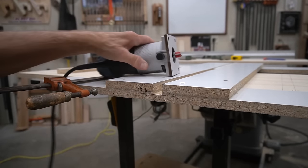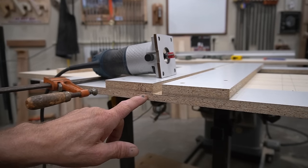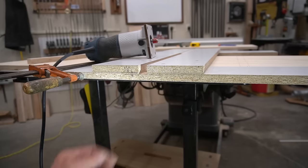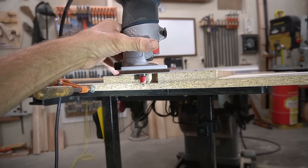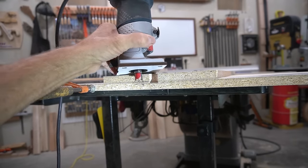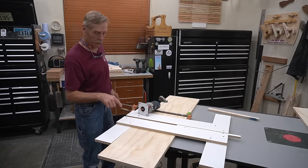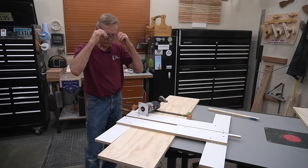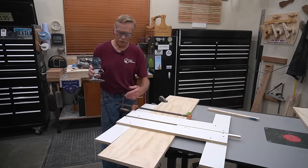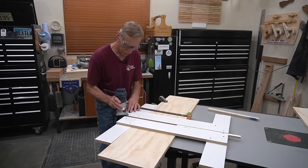Another great thing about this jig is that you can use pretty much any router. I'm using a small palm router with a five-eighths inch diameter, half-inch cut length bit with a top bearing — a Freud bit, though brand doesn't matter. The most important things are that the bit diameter is equal to or less than the slot width, and the guide bearing is on top of the cutter so it follows the template while the cutter cuts below. Setting depth of cut is simple: total distance from router base to cutter end equals fixture thickness plus depth of cut, which here is one-eighth of an inch.